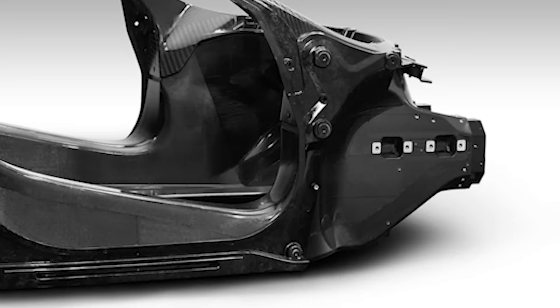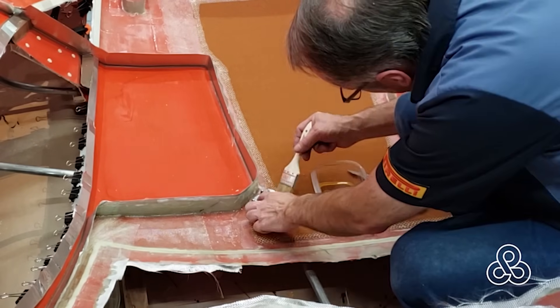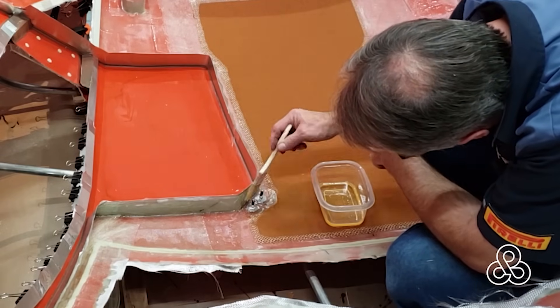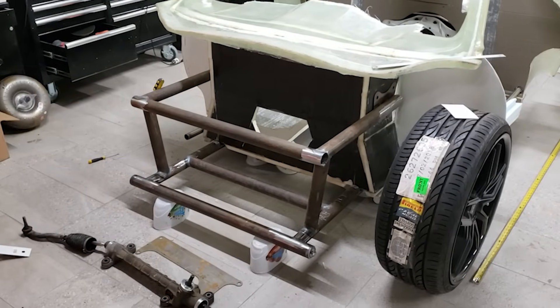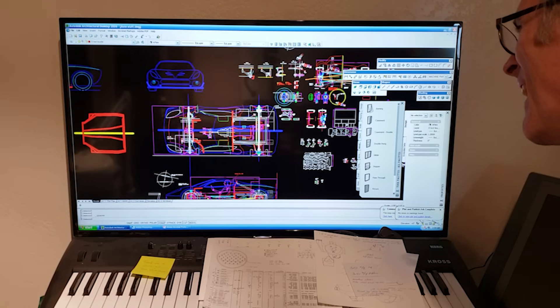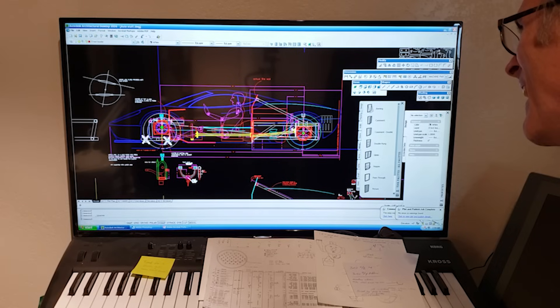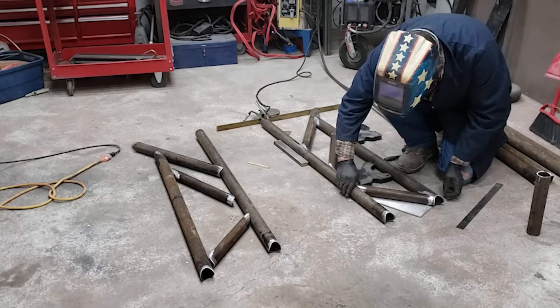In composite structures, you can design so that suspension and drivetrain components attach directly to the matrix. However, these high-stress areas require special embedments and a high degree of engineering to transfer loads throughout the monocoque. I chose to reduce complex attachments by using steel tube or chromoly subframes front and back, which carry the suspension and drivetrain attachment points. Although the whole project is generally planned in CAD, I often create components that don't rely on any particular prerequisite or assembly line — the subframes act as subsystems built separately that all come together as the build develops.